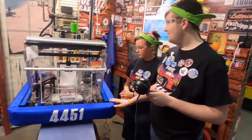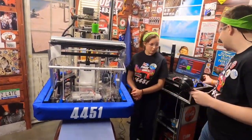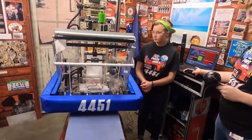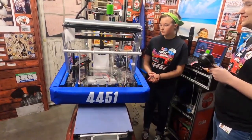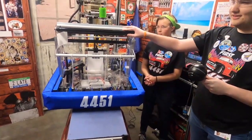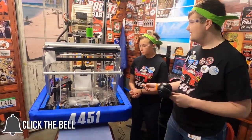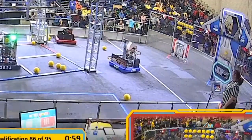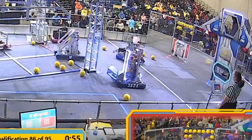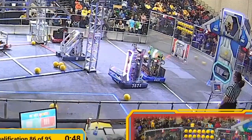The first thing I want to talk about on the robot is our intake. It flops up normally at the beginning of the match, and then when we need to deploy it, we have some pneumatic cylinders that push it out and flop it down — one controller — and it can suck up balls. When we run our intake, it runs not only the actual mechanism that picks up balls, it also runs our agitator and the base of our tower, so we can automatically get a ball inside our tower first to reduce jamming. When one ball hits the limit switch, it stops the agitator and the tower motor, getting one ball in the tower and four balls inside our hopper to reduce jamming.